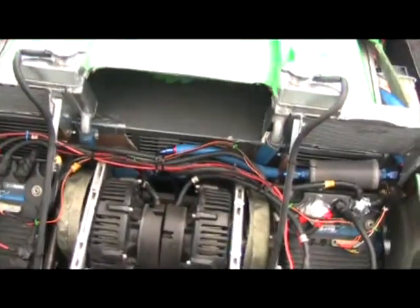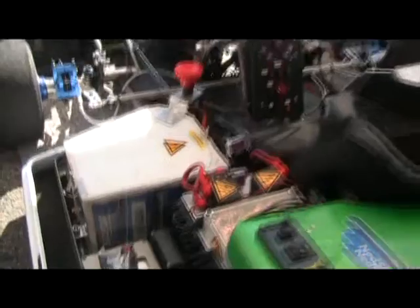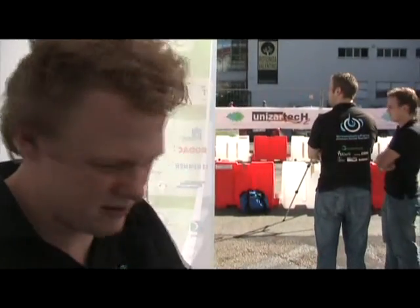The fuel cell produces energy as electricity. That electricity is fed to a converter which steps the voltage of the fuel cell up to a higher level, because we need that to run our whole system. The converter output is then fed to our storage system — these blue super caps. They are supercapacitors, each 3000 farads, and in total we can store 250 kilojoules of energy in them.